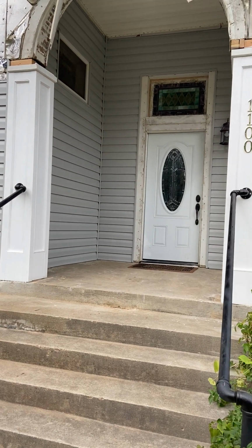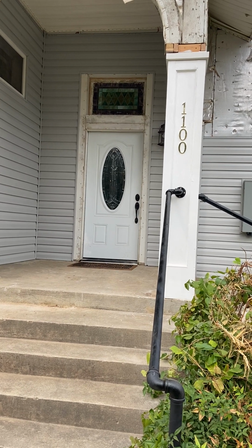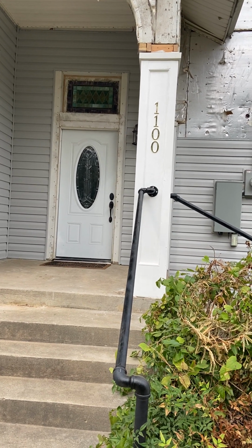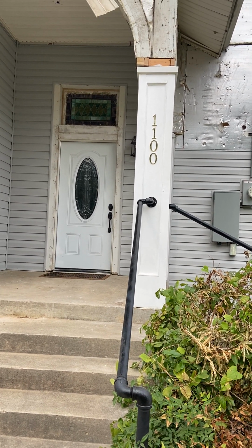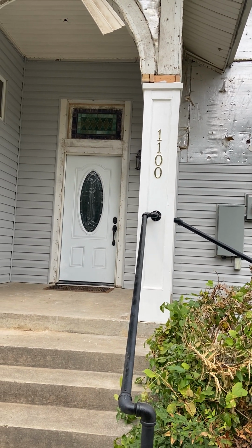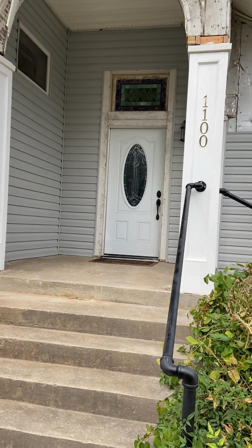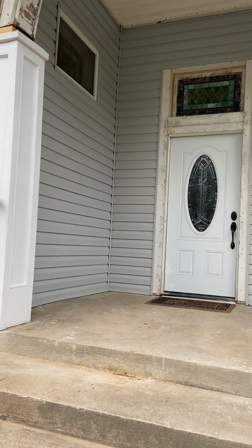It took about 500 pieces in a couple of weeks to remake these surrounds for the supports for the pillars. I cut the pieces for the top that are 4.5 inches wide that miter around the top. I cut them too short, so I can't put the dentals in. Those look like little teeth. I haven't put the cove molding on yet, but these are 90% done, and they look pretty good, and they're going to be pretty close to what it was originally. So that's good. The porch looks a whole lot better having siding in there.